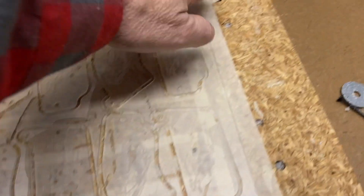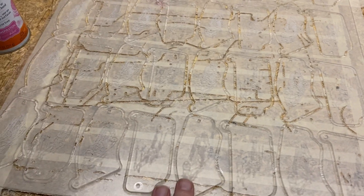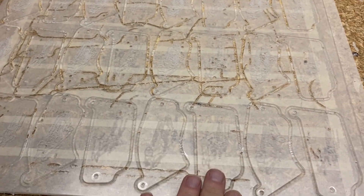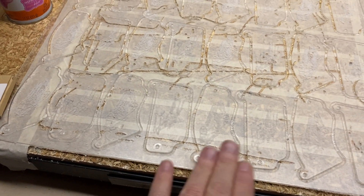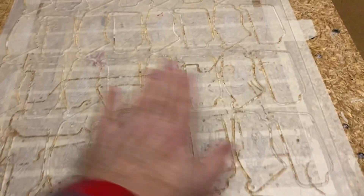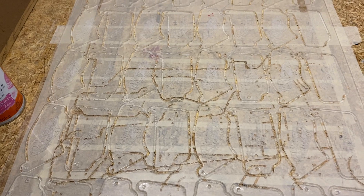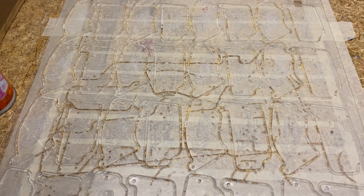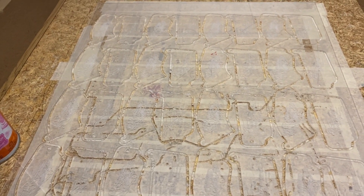I don't have to use two layers of masking tape because one side of the acrylic already has a plastic protective coating on it. I take it to another room — my spray room — and spray one side of the plexiglass that still has the plastic cover on it nice and thoroughly all the way across with the spray adhesive. Then I bring it back and press it down hard on top of the masking tape and give it some time to cure.